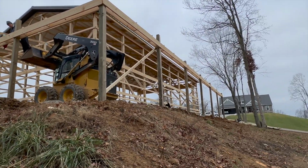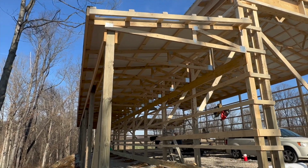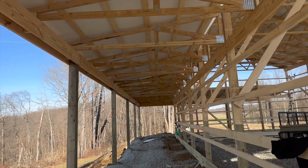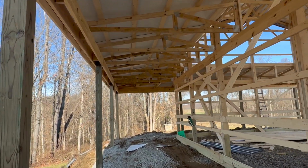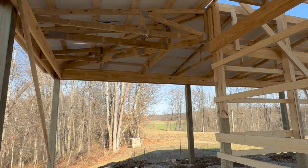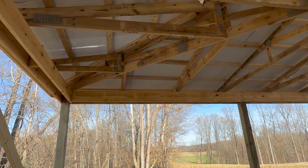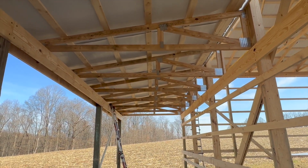And then it goes down that way. Getting it under roof. Trusses are up. I'm going to go through here and show you guys. We're going to be running our electrical here for recessed lighting under here, probably tomorrow. As you can see, 9 foot ceilings, and it's 10 foot wide. And we'll be putting 8 recessed lights on this side here, and then on the back we're going to do 4. Or you could say, because one's going to be right here in the middle, you would say 5 down the short end and then 7 down the long end. Or you could say, with this one here, 8 down this long end and 4 down this way. You guys kind of get the sense. I'll show you when we're putting them up.